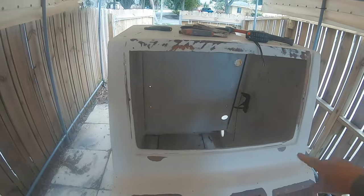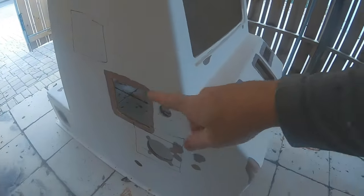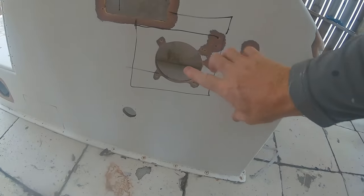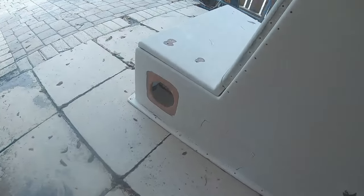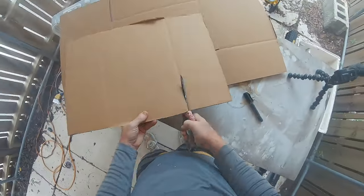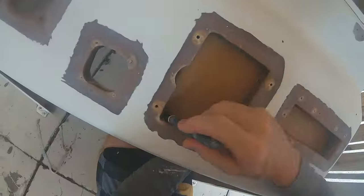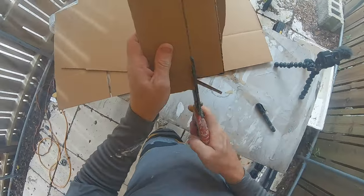This is going to be filled in with acrylic. We're cleaning up some of the spider cracks on the side, and you can see where there were some old speaker holes. He's adding a T-top, so I added some reinforcement to the inside to support it. There was also some damage on the front, and I just got started cutting some cardboard templates to make pieces out of marine grade plywood to fill in these areas on the dash.